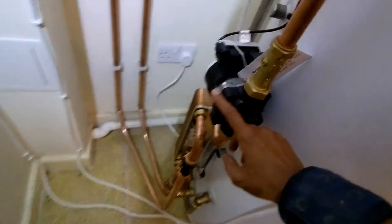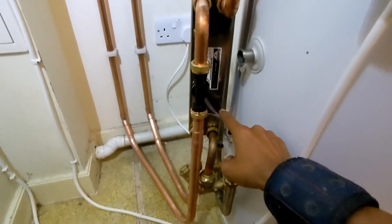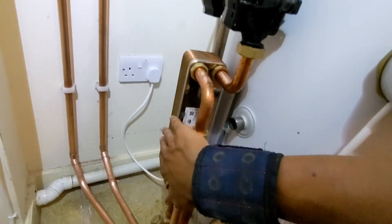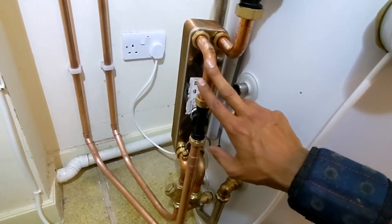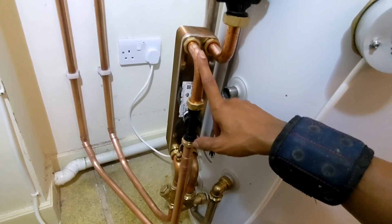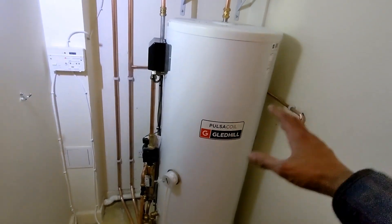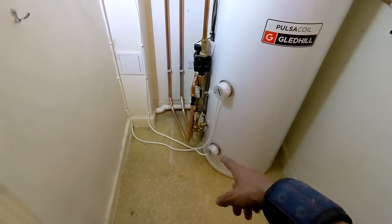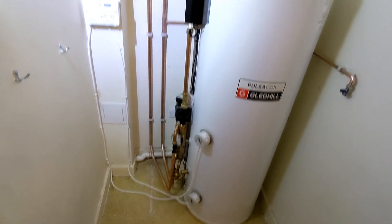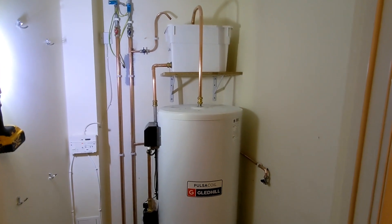When there is a demand, this pump here will basically start spinning. What it will do is pull the hot water from there, going through the plate, and then returning back into the bottom. It takes the hot water from here, that heats up this plate, and then that transfers the heat to the domestic side - just like a normal plate heat exchanger in a combi boiler - and that gives you your hot water delivery at all your tap outlets. The benefit is you're still going to get mains pressure hot water at your tap outlets, but you haven't got the hassle of fitting a combination valve, pressure reducing valve, PRV, expansion relief valve, expansion vessel - none of that. This doesn't even need any servicing. It's literally just two immersions - boost and your off-peak one - and you need another power supply just so the PCB knows which powers the pump. That is literally it: two connections, cold in, hot out, and then you just do your other little bits for the fill. It's a very, very simple option and it's easy to pipe up as well.